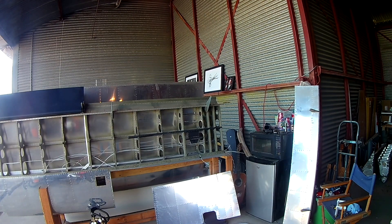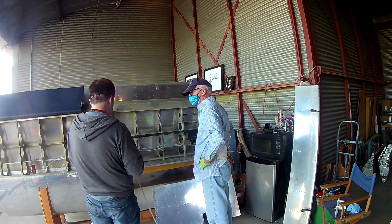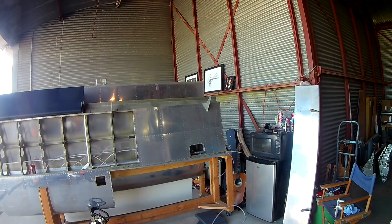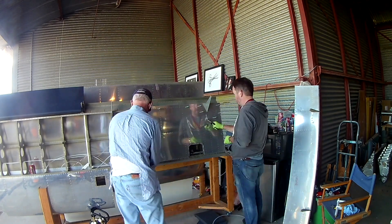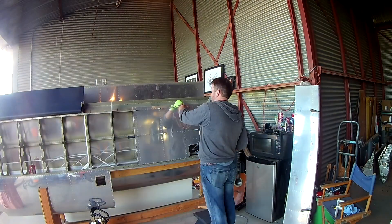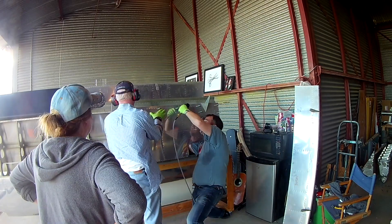We had to take off the tank, and it turns out that when Ted and I were doing these the first time we missed about five rivets. You would have never noticed with the tank on, because it has a flange that covers them — basically one rivet per rib for a few of the ribs right by the flange of the wing spar. We took care of those when we had the tank off. With those done, we're now going to start riveting on the back skins — starting with the interior skin, but only the very back half. Remember, when you look at this wing, it's hung upside down so you have to keep fore and aft straight in your mind. We'll get one rivet here, and in the next video we'll do a lot more. Thanks for joining me — hope you're having a good week, see you soon.